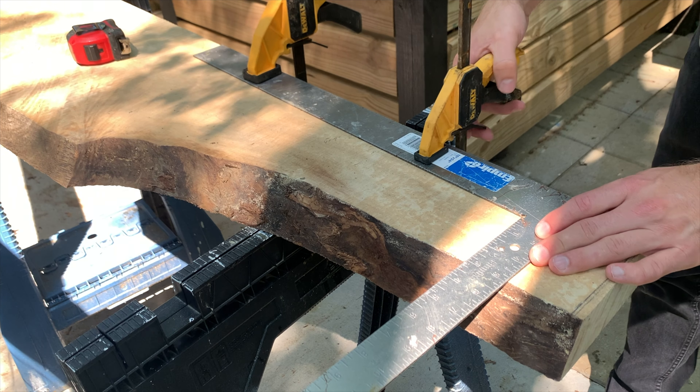We finally got the last piece off. After chipping off all the rest of the form, you can see we're going to have to mill down around a half inch to get everything uniform. I took the tables back to the same guy on Craigslist where I bought the slabs and he milled them down using his equipment. If you're just doing a one-off project, it's 100% worth it. There are DIY methods like a router sled but it's a lot of work — if you can find someone nearby who can mill the board down flat, it's almost always worth the money, takes half the time, and is far less dusty.